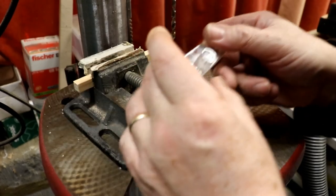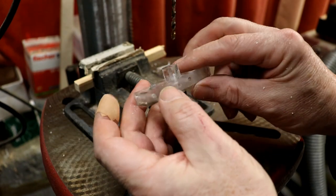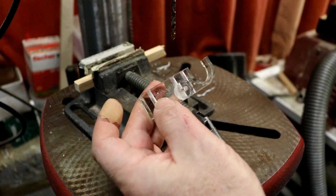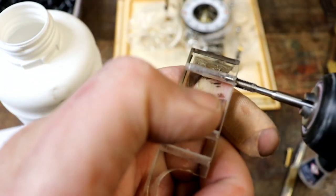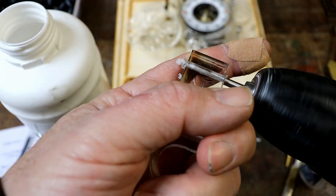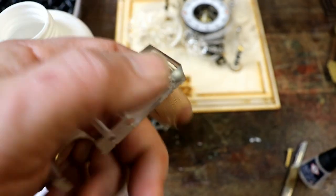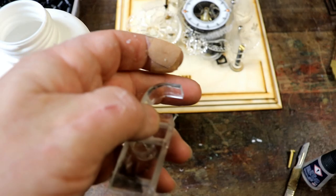Yeah, it's as simple as that. So that's nice. We've got the hole on M4 for the rivet, etc, etc. I will now tap these. It's that way, check, it's that way, and that's absolutely fine. That's good, and you saw all the swarf coming out the top. I'll do the other ones.